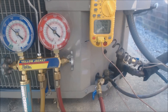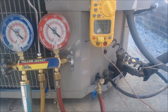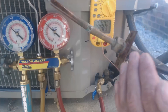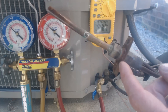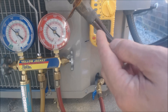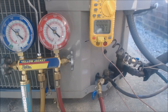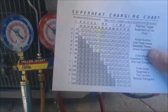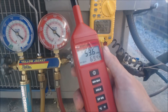Now if we have a piston as a metering device, we check superheat on the vapor side. You'd see a small nut here — inside there's a piston. Or you might have a capillary tube, which is just a small tube without a visible TXV or piston. In either case, you need to check superheat, which is checked on the vapor side, and you'll need a superheat charging chart.